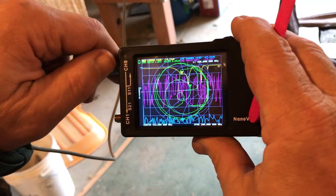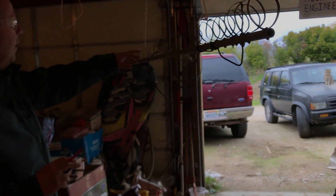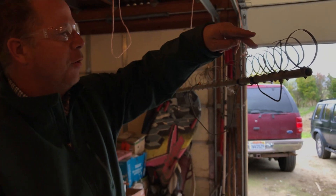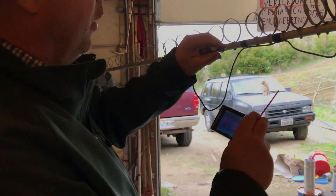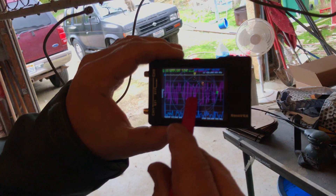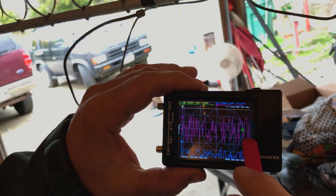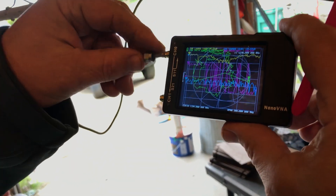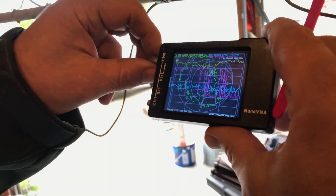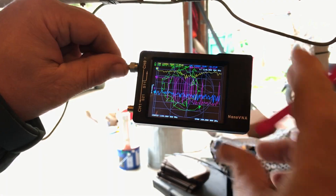Now I'm going to check my 1296 MHz antenna. Let me disconnect and walk over to it — it's the highest frequency one that I have. This Yagi antenna has 25 elements and I'm feeding it with coaxial cable. First I have to get the calibration hooked up for the 1296 MHz segment, which is my recall state 4. Now I'm at 1296 MHz scanning 200 MHz. This unit actually goes from 50 kHz all the way up to 1.5 GHz, but you can see the signal-to-noise ratio isn't quite as good above 1 GHz, but it still makes a reasonable measurement.